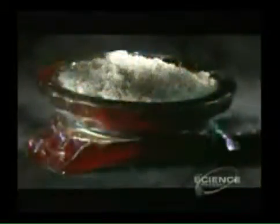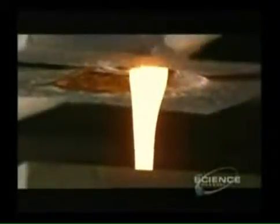To make marbles, this company melts recycled glass with marbles made earlier, but rejected for being the wrong size. All this goes into a kiln heated to 2200 degrees Fahrenheit. After 16 hours, they open a door at the bottom of the kiln and the molten glass flows out.